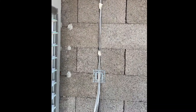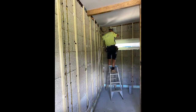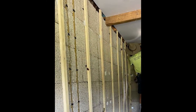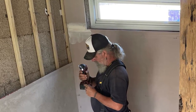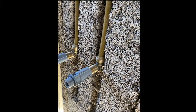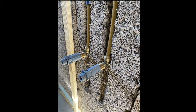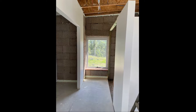We use an electric chainsaw to create the groove. When we tile, we like to keep a gap in between the sheeting that will be waterproofed and tiled, so we batten out that part. Here we're attaching the back-plated water outlets to the wall, and that will be sheeted and waterproofed.